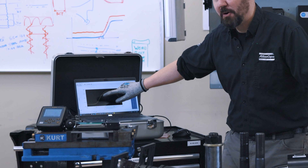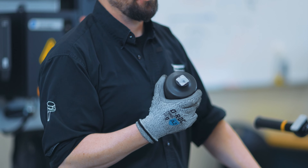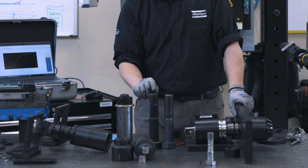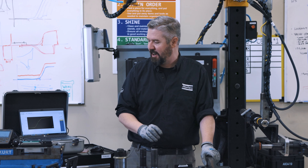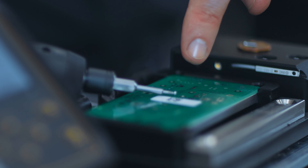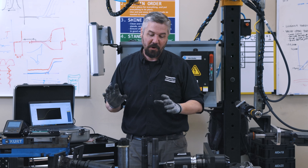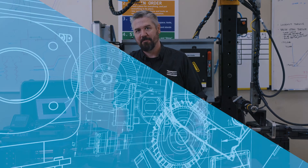Let's take this apart and check it out. We almost broke the bolt — we took it way past its yield point — but the one-inch square drive adapter wasn't up to the task. We couldn't quite break the bolt, but we did yield it, stretching it a full quarter inch longer than when it started. Almost a failure, but we'll need a more robust setup next time. We did break the M1.6 at 0.4 newton meters, and went over 4000 newton meters trying to break this bolt — a 10,000 times difference in torque. We'll get this set back up and try again next time.